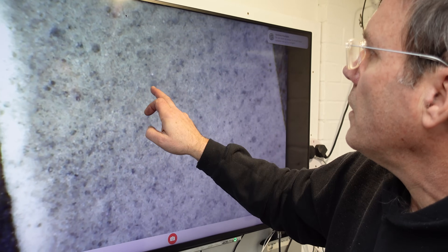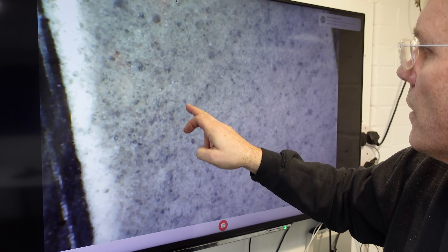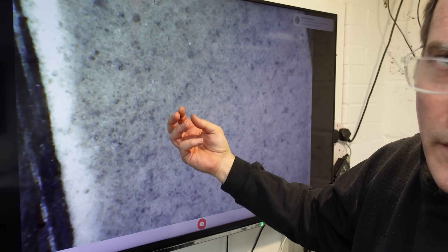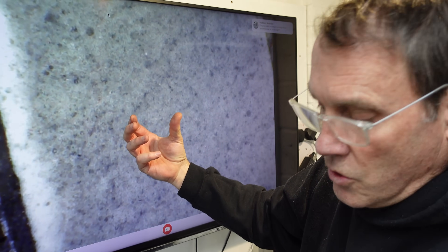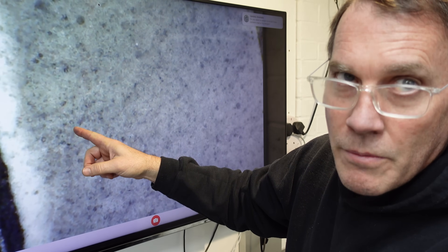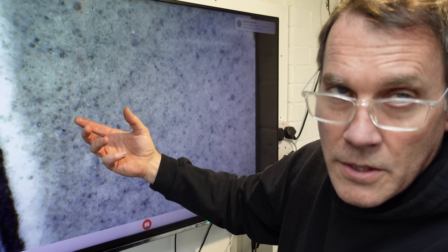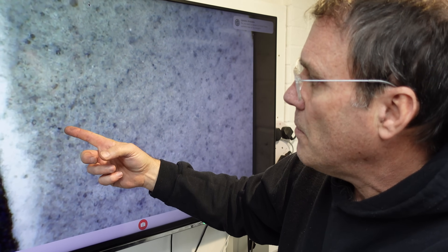See these little dots here? Those are air pockets — gas pockets. What happens is when this is an epoxy that is cured, it's not a foam, it's just pure epoxy. Basically these are escaping gases from the thermoset — 'thermoset' means thermal heat setting — and the byproduct is air pockets.